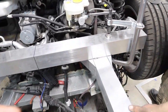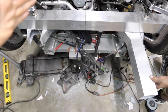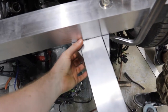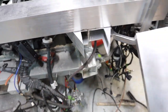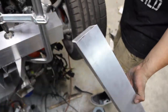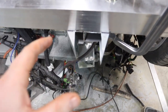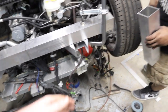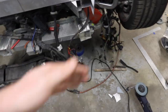Oscar just wrapped up cutting everything, slotting it, and building our front posts. On the Huracan, the posts actually come out at an angle — they go out like this and out like this. We're copying the exact dimensions of the stock Huracan. Rather than welding them in right away though, he noticed that when we pull them out we have multiple steps in the back because these are different size pieces of metal, just like on the Huracan. So what he's going to do is build a half cap on here — that way when he welds through everything, it's all capped off, waterproof, looks great, sealed up, and very strong. He's going to cap those off, bring those posts over here, and tack those in for the time being, then we'll start moving on to the bottom ones.